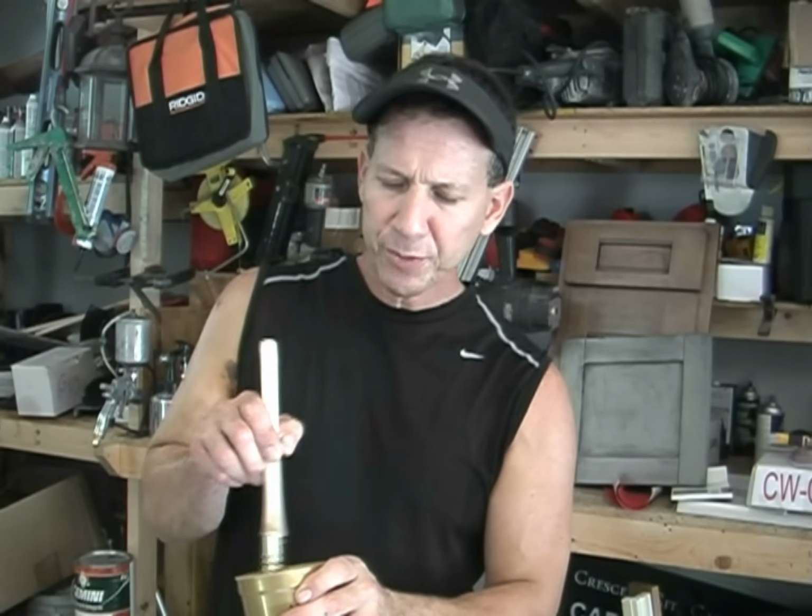I take my brush and I let it sit in mineral spirits when it's on the side and I'm not using it. I don't want it to gum up. It's easy to clean. Once you put it in mineral spirits, all you have to do is tap the sides, take a rag, wipe it off, and you're ready to go again. Now, if you're going from black to a real light color, you can wipe it real good with your rag, dip it into a clean jar of mineral spirits, and then do it again. Once you rinse it a couple of times, it's perfectly clean.